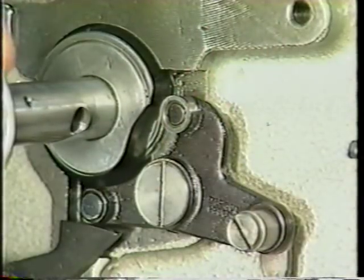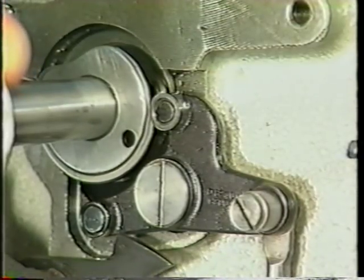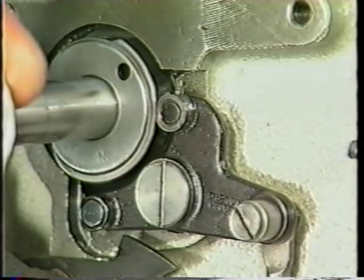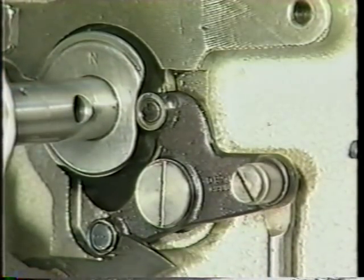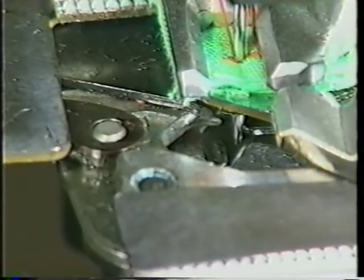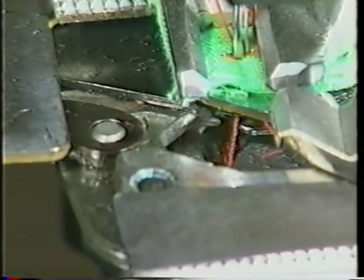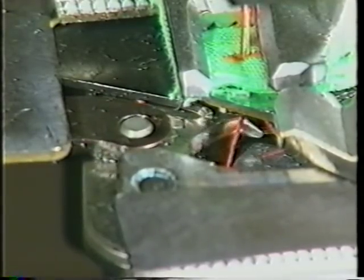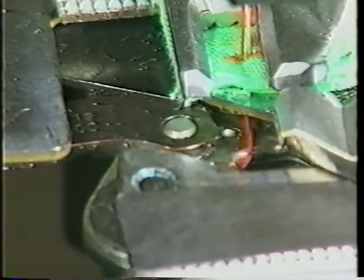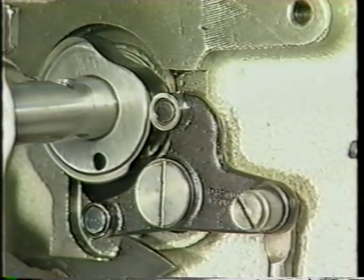The stop motion regulating cam roller comes down from the low speed section to the stop motion section. The thread trimmer cam arm roller comes in contact with the thread trimmer cam and the moving knife moves forward. The top end of the moving knife passes through the needle thread triangle to catch the needle thread and bobbin thread. The moving knife returns from its backward motion end and the sewing machine enters the stop motion state.